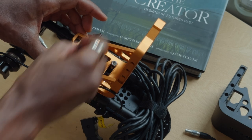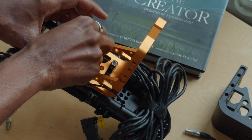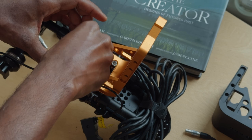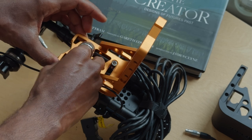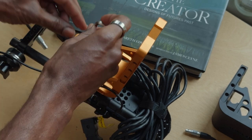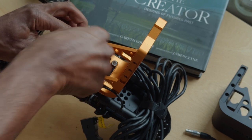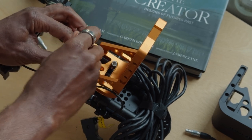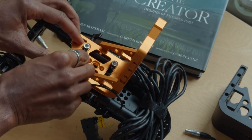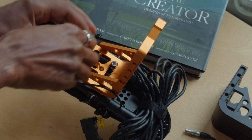We start off — like I showed you in the other video — by putting in the quarter inch 20 bolts into the 15 millimeter rod supports. I've designed this so that you can basically put it into any kind of support. You've got the countersunk holes where you can put the quarter inch 20 bolts at different distances apart depending on which fixings you have. I'm tightening up the quarter inch 20s here, all four of them in position and tightened up. This is going to give the gimbal bracket a very sturdy fixing to the shoulder rig.